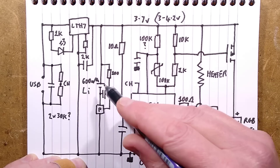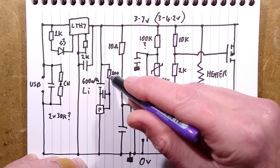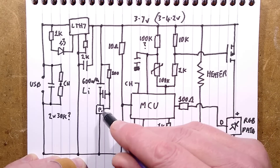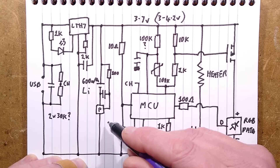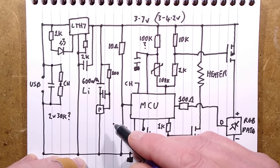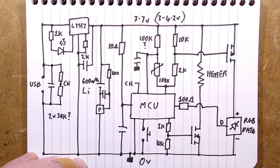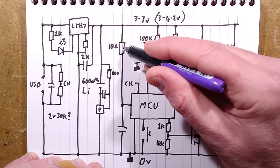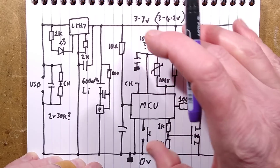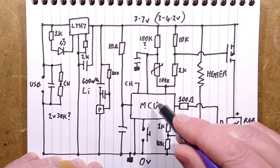Decoupling capacitor. There's the lithium cell — the miserable lithium cell — with a little resistor-capacitor network across it with a tap-off going to the protection chip. The chip may have a high pin count but effectively only uses three connections. The microcontroller has its decoupled supply: a 10 ohm resistor feeding a capacitor that isolates it from switching on the lines and gives it a fairly stable supply.